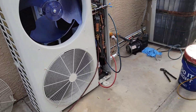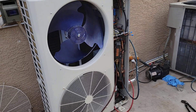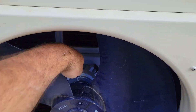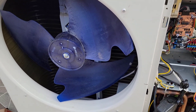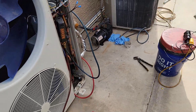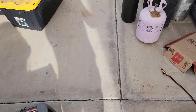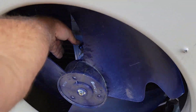I might actually have to pump this refrigerant back out into this unit and hook this unit up real quick just to have it running again until I can figure out something else. Maybe I could find some of these motors. I kind of overheated this motor - I hooked it up to a small VFD just to run it temporarily, thinking I can run the AC to cool the house a little bit before I shut it down. It ran a few minutes off one of these small VFDs, then it tripped and I might have cooked this motor.